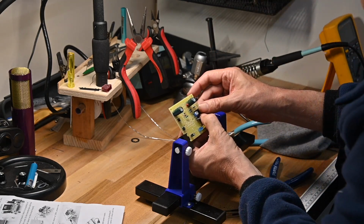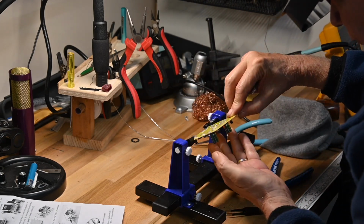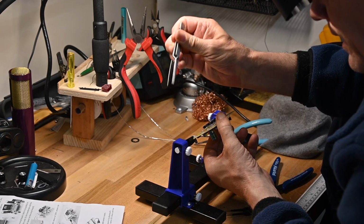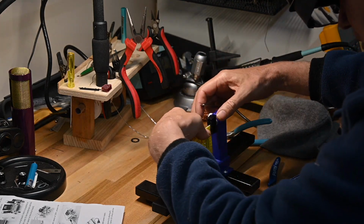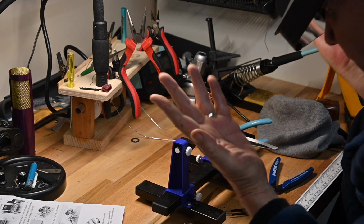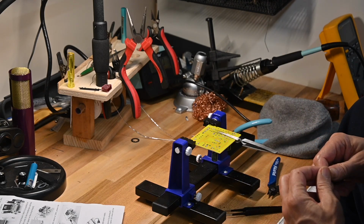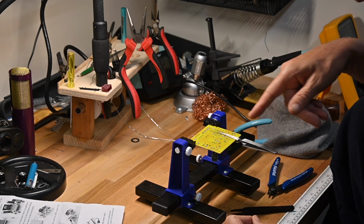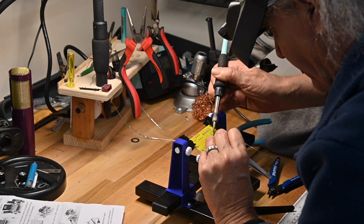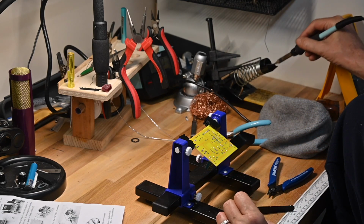Yep, goes right in. Now again, here's one of my secrets. So instead of just flipping the board over and hoping the IC stays in or using tape or whatever, I use locking tweezers. I go in, lock it in, and now I don't have to worry about the socket being uneven, pulling loose, or falling out while I'm trying to solder it. These locking tweezers, they eliminate so much frustration. And the IC socket is on the board.